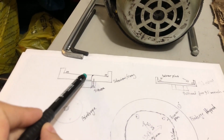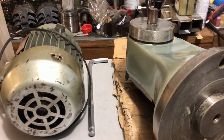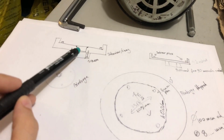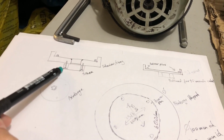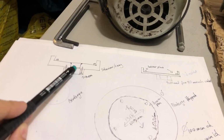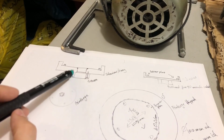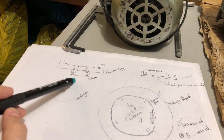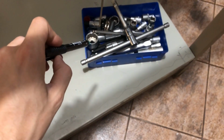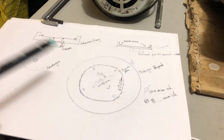I will bore out clearance for the spindle protrusion. Of course, the drawbar will be removed. The bore itself will in turn allow me to fit a hex head bolt modified on a lathe, reduced down to just a short shoulder that will retain it squarely in the body and centrally, with 6 or however many small bolts I will get to retain the head and allow it to drive this piece. That will in turn allow me to use the 30 wrench over here, or rather the socket, in tandem with the breaker bar to drive this really nicely without the possibility of bending the pins or whatever.